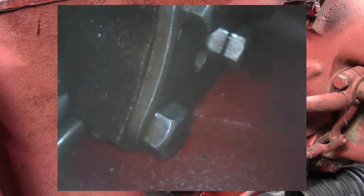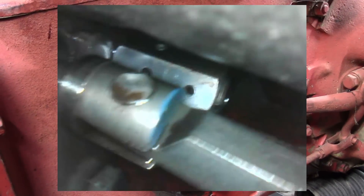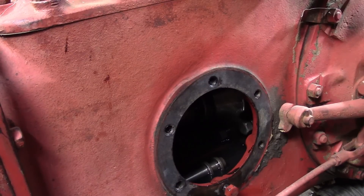As we're looking up inside, that shiny silver part is the piston. As you can see, there's no fluid at all leaking from the piston. Now we're going to turn the camera toward the front of the tractor — there's the valve body. And you just saw a drip come off the front of the valve body. I don't see any leaks up there on the face plate, so now we're going to move more toward the front of the tractor, which is the other end of the valve body. You can see a pretty steady drip right there coming off that valve body.